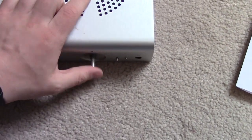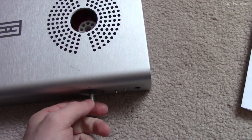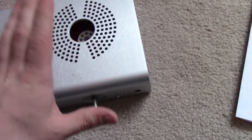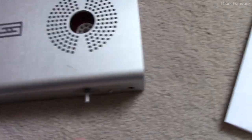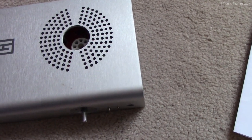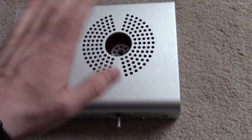Don't press on the volume knob shaft to try and do this - the pot is an expensive pot and I would not apply any mechanical force to it. You need to grasp the sides and do it that way. I'll do that with two hands and come back.